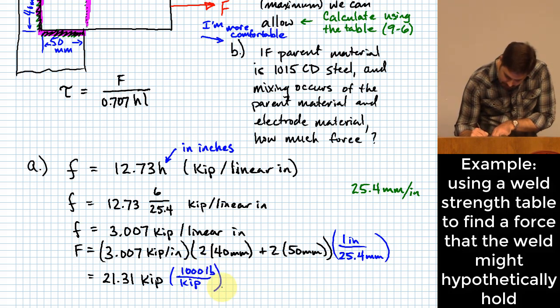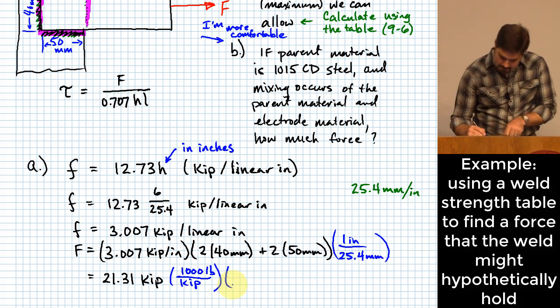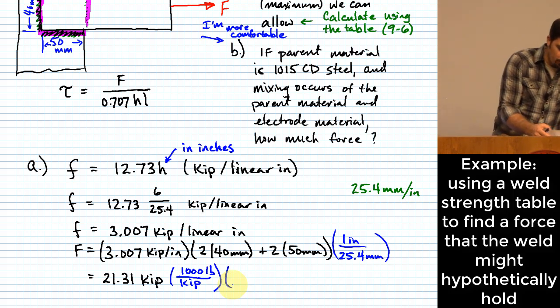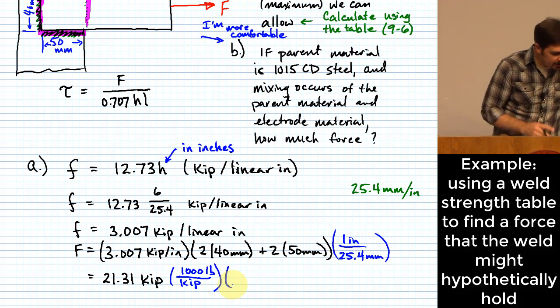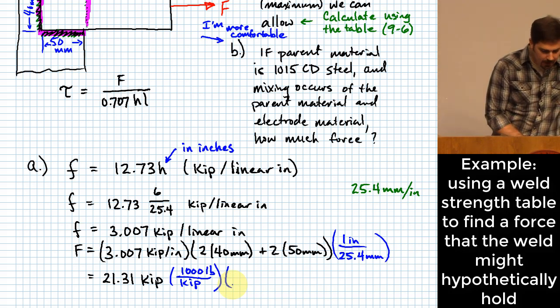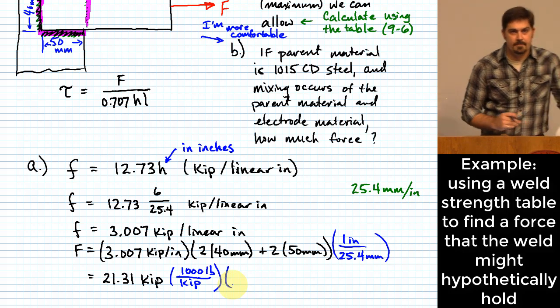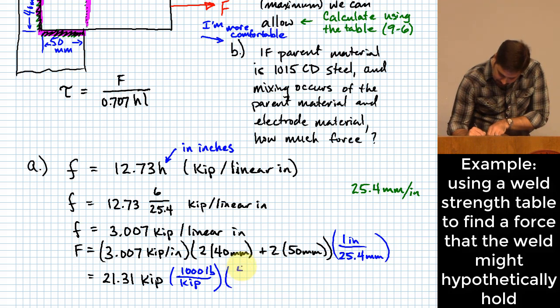But then what else do we need to know? Yeah, and the number for that is available. It is 4.45. I know that because I've done this a good number of times. But if you look at table A2, page 1014, 1 pound is 4.45 newtons. So what we'll do here is do 4.45 newtons per pound.